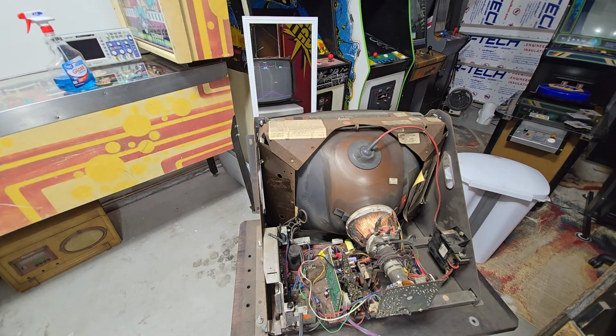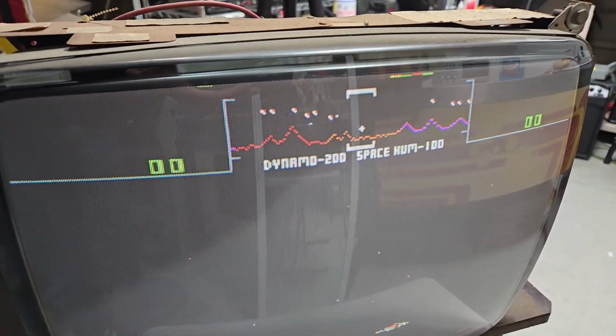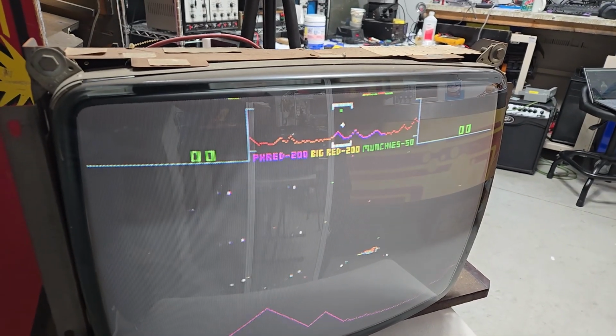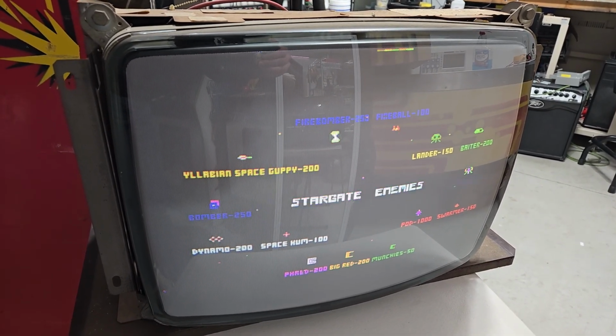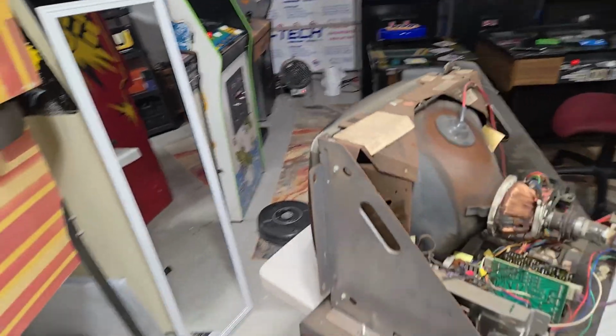But vertical fold over is gone. You just got garbage at the top of the screen now where it's supposed to be. So that's normal. So yeah, see here. The garbage at the top of the screen is at the top of the screen now where it belongs instead of either off the edge of the screen or wrapped around into the screen. So that's perfectly normal. I'm not sure if the horizontal linearity has been changed. That had a little bit of an issue. But the game is running with the new decoder for PROM, so I think we're in pretty good shape.